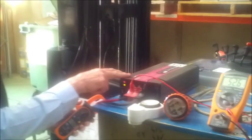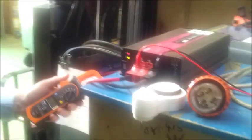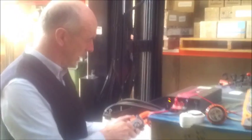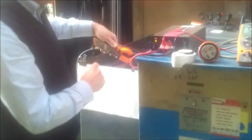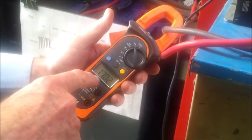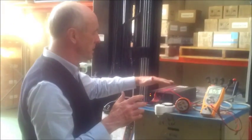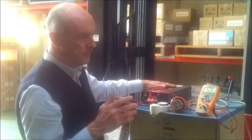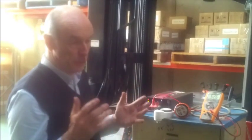At the moment, we're charging with the single phase charger — a 48 volt lead-acid battery. We're charging at constant current, at around about 16 to 17 amps DC, and we've got about 52.6 volts on the battery. The most important thing about this charger is, even though it's only 1,000 watts, it will charge a battery which is much bigger than what you think it's capable of, and still bring it up to full power. In fact, it will recondition it.